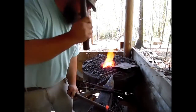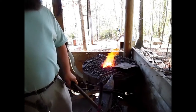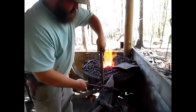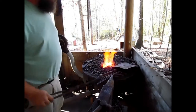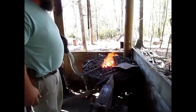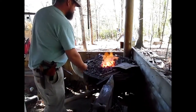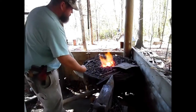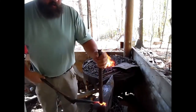You've got to keep that eye nice and centered. Make sure you work yourself into that corner. Now I'm about where I want to be on this eye. So now I don't have to drift it anymore — I'm going to use the drift as a spacer for my anvil. I'm going to forge against the drift, and I'm going to widen the eye cheeks out somewhat to get more bearing on it.